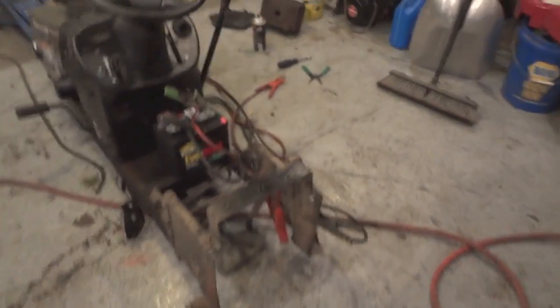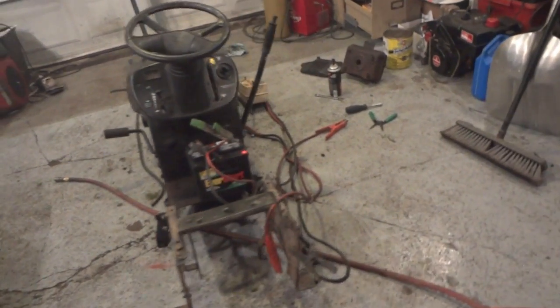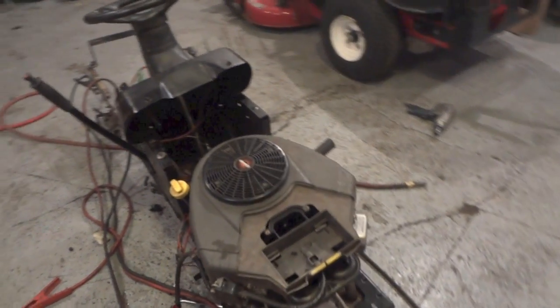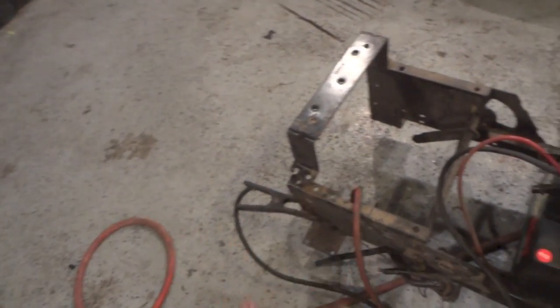I'm calling it quits on this thing. I got it somewhat running - it just wants to pop and then kind of do its thing. I couldn't bypass the seat safety because the wires are cut when I pull seats off, I usually just cut the lines. I'm sure once it's on a proper tractor it'll fire right up no problem - I just want to double check everything before I sell it. It runs for about half a second and then dies because there's no one in the seat triggering the seat safety.